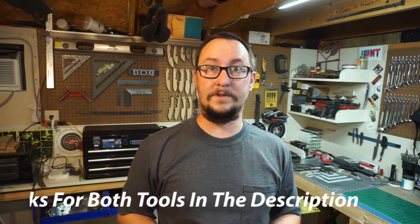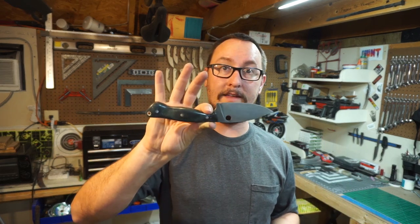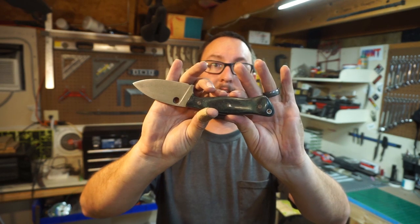Let's recap what we did. We got it on the 1x30 — we did that stuff outside because it was insanely dusty — and hopefully y'all enjoyed that because I know more of you have 1x30s than 2x72s, and that shows you what you can do with something as simple as that machine. You can also get these oscillating spindle sanders from Harbor Freight, just like the 1x30, anywhere between 60 and 100 bucks. Do all of that plus a lot of hand sanding, then buff it with a green compound on the soft wheel — and you get that result, if you just take your time.